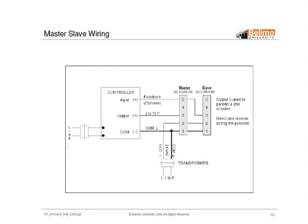What was just mentioned is important: this applies where you have two actuators physically connected on the same shaft of a damper or on the same shaft of a valve. That's not to say — if you have an outdoor air damper and a return air damper, it isn't necessary to slave those two together because they're not physically connected to one another. It becomes less important on outdoor and return air, but it becomes critical when you have two motors on the same shaft. When you send something out from the factory as master-slave, are they pre-wired together? No — they're two separate motors. The installer would need to know how to wire that.